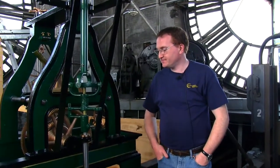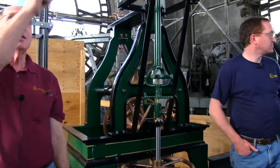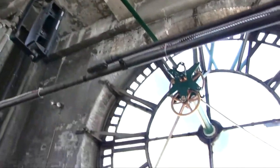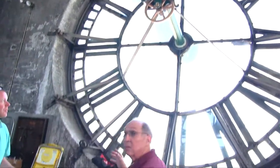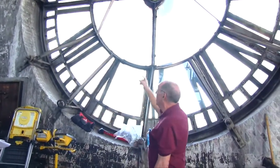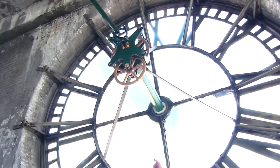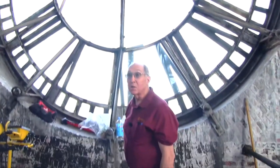What's the ratio of the hour hand to the minute hand? 12 to 1. This shaft turns one revolution per hour. We need to gear it down to drive the hour hand — the hour hand only makes two revolutions in a day, but we cycle on 12 hours. So we have this shaft turning one revolution per hour, and the tube inside to the hour hand turning one revolution per 12 hours. The ratio is 12 to 1. Unless you're military, it's 24 to 1, but it's principally the same thing.